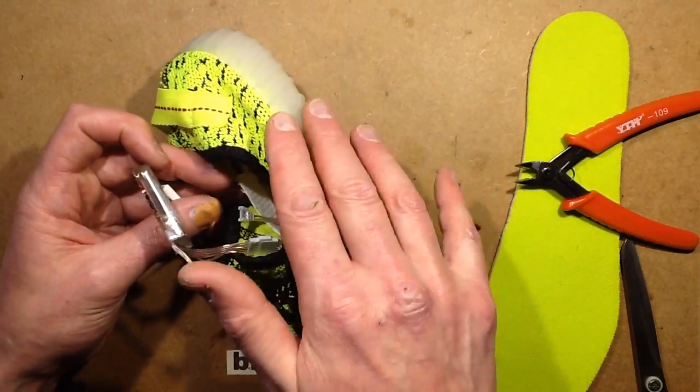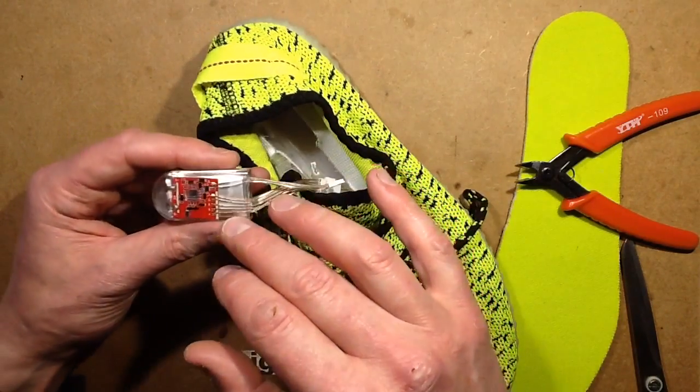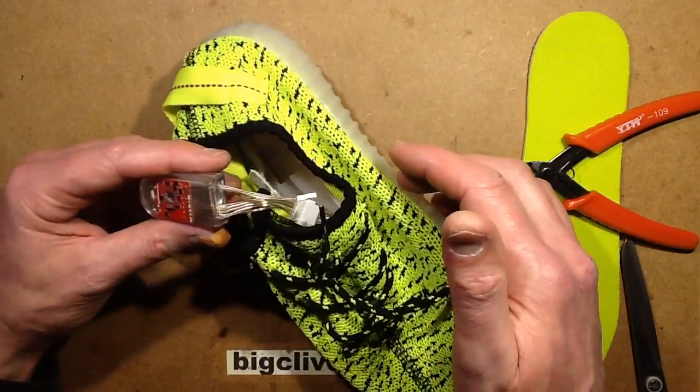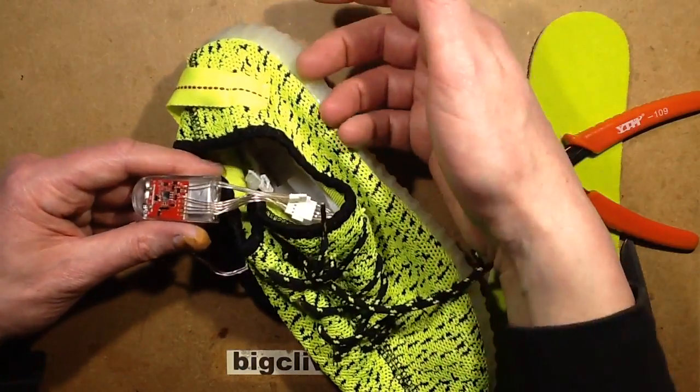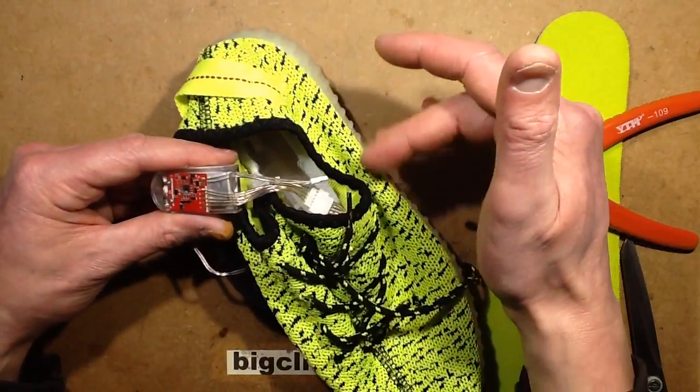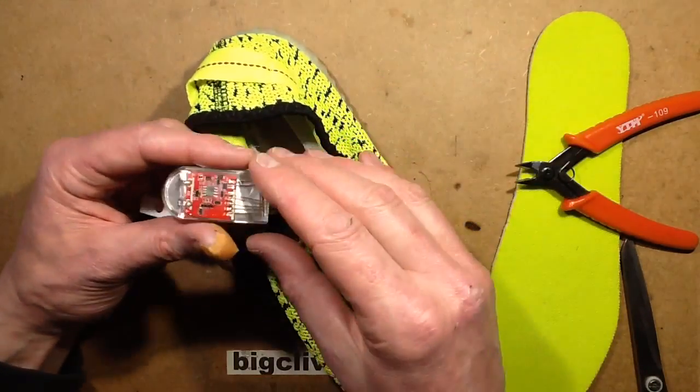So they would maybe put out one colour combination of red, green and blue, and then enable the common for one set of the LEDs, and then change the colour and enable it for the other. And if they had them all on static colours, then all they'd do is put the colour out and alternate between the two channels to make them look as though they're lit constantly.